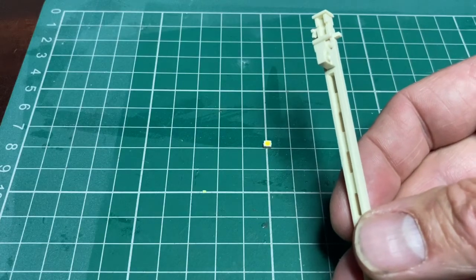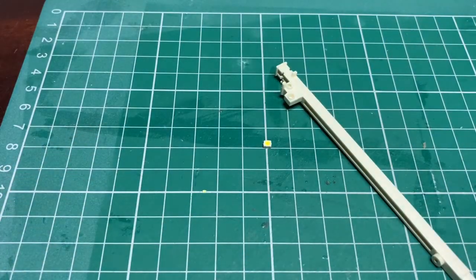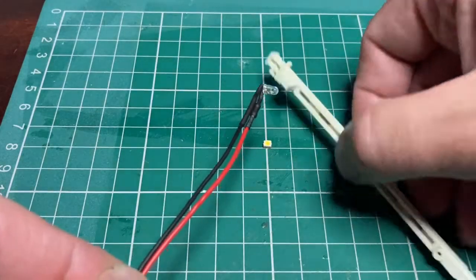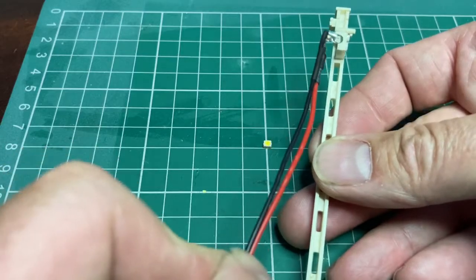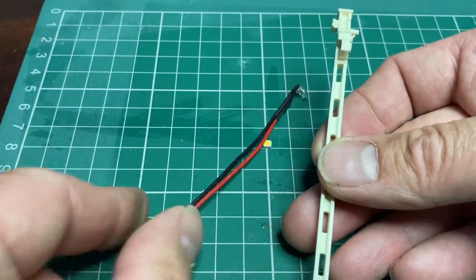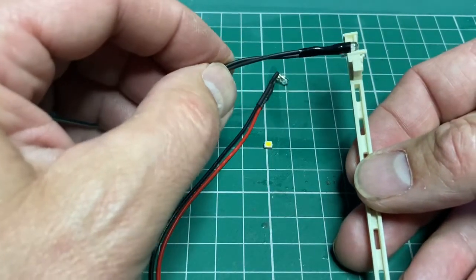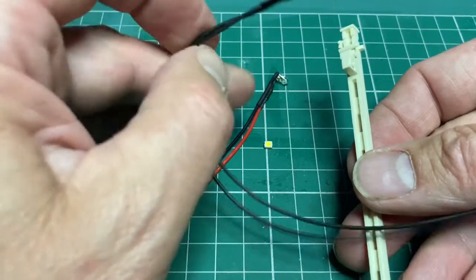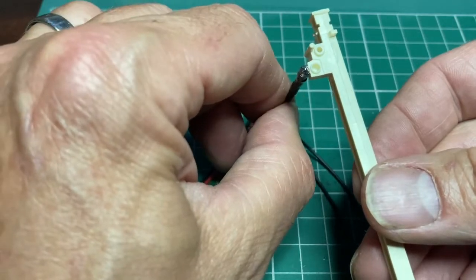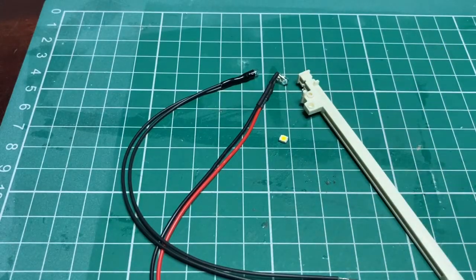I've got another couple of options as well, which I was thinking about while I was doing that, and I don't think they'll be as good. One is just an ordinary LED. That's a 3mm LED, which I think is just going to be too thick for that lamp, because it would have to sit back here somewhat, and I just don't think it will be very tidy. And the other idea I thought about was possibly having just like a grain of wheat bulb, but I think it's going to be far too bulky. And it'll probably look nice because it will be quite a warm glow rather than quite a harsh LED, but I just don't think the size is going to help us. One other option I'm going to look at, which I'm just now going to solder up.